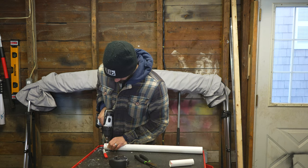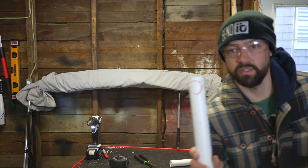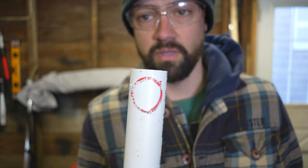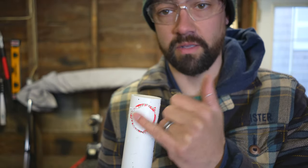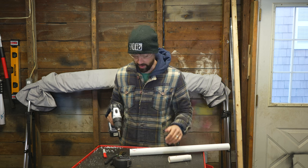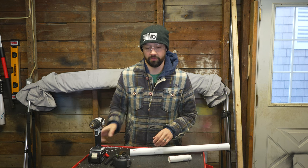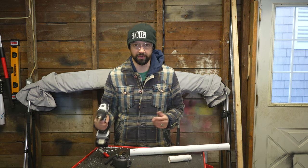You're going to aim big around that mark and basically just drill a ton of holes. As you're drilling it's going to look like a bunch of little tiny holes, and then you want to take a screwdriver or something to get rid of the stuff in between and get all of that out. You can also take your drill and run it in each hole so it actually kind of acts like a router. Or if you have a Dremel tool, you can grind it away with a cutting blade or router blade. It is all kind of dangerous, so be careful.